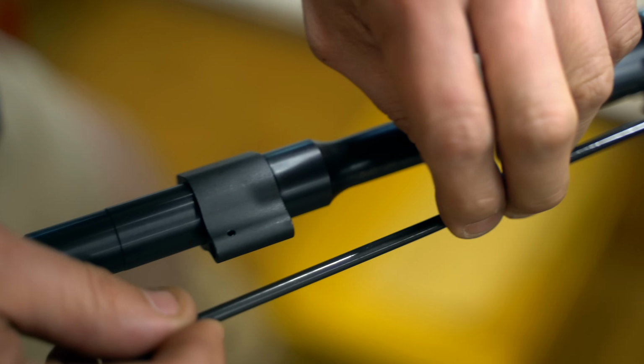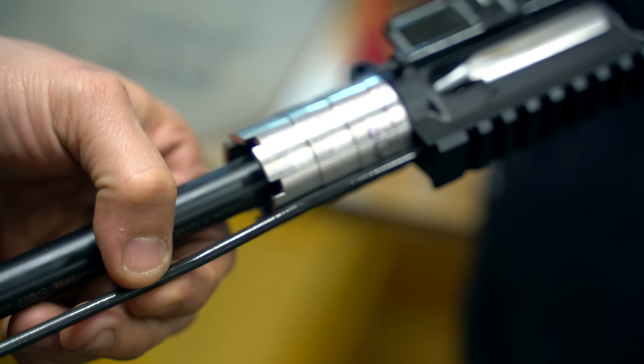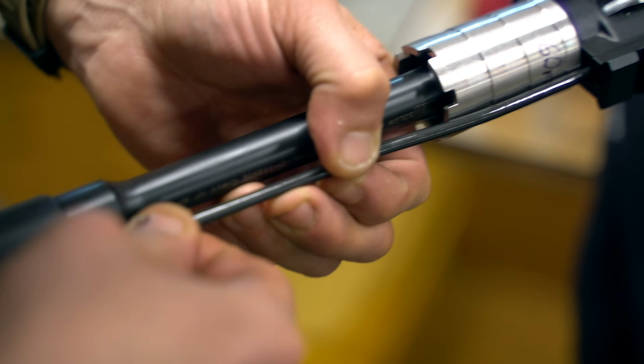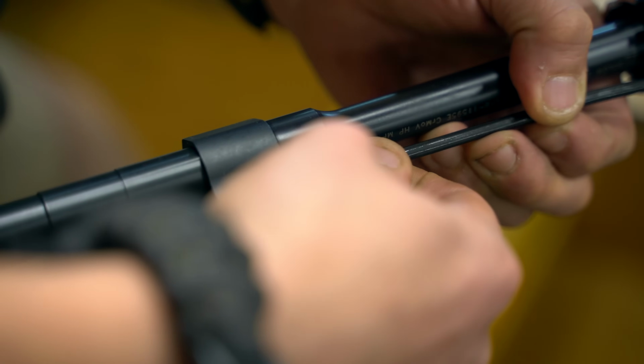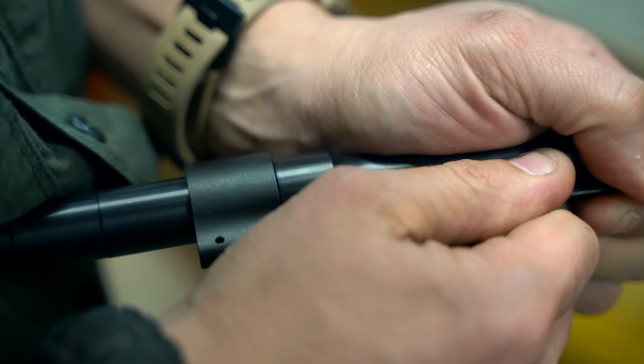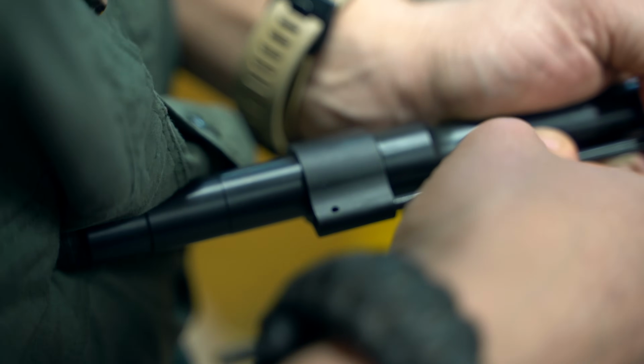So the dimensions, barrel contour, all of these different things, to include actually gas port size, which is really, really important when you're actually firing a gun, because if you have something that's gassed incorrectly, you either have way overgassed, to where one, it's unpleasant, early parts wear, and if you ever put a suppressor on it, it's just going to beat itself to death, or undergassed, where you have honestly serious reliability issues with respect to being able to shoot that gun and have it function with pretty much any ammo out there.